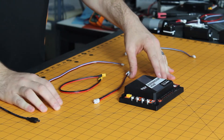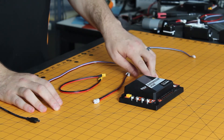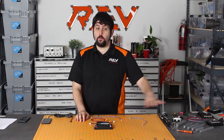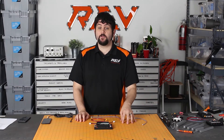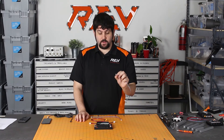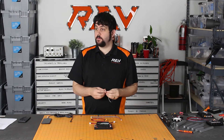The next ports on your Expansion Hub are your RS-485. This is used as a communication standard to connect multiple hubs together. You can connect a whole bunch of hubs together, but for the FIRST Tech Challenge, you're only going to be using two on your robot. The RS-485 uses a three-pin JST cable, and those come with your Expansion Hubs.